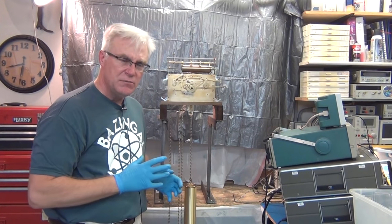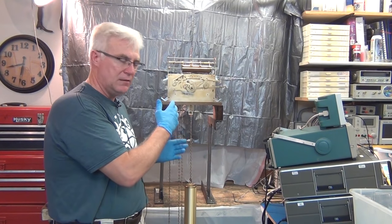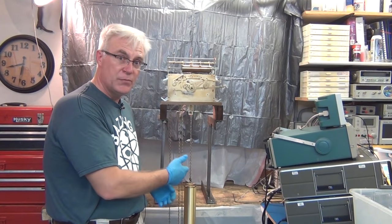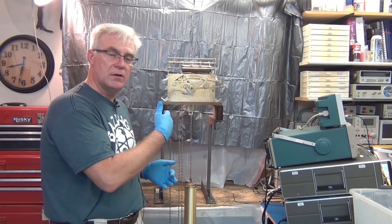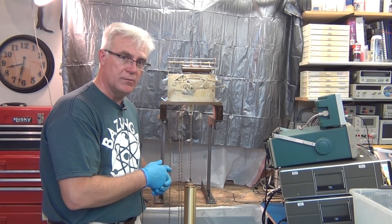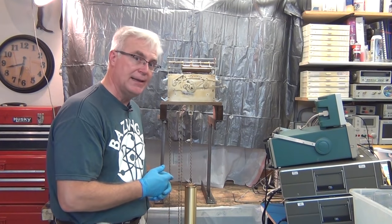The reasons you'd want to do a chain: sometimes the chains get locked in too high a position and you have to get them out. Sometimes you want to service the clock and take the mechanism out. Sometimes the chains get tarnished and you want to replace them. Sometimes the links get stretched, causing problems with functioning, and you want to replace the chains. You can buy replacement chains from clock parts sellers online.